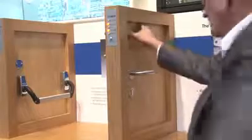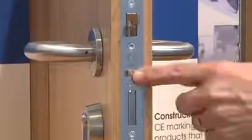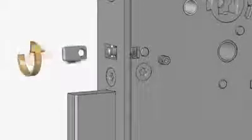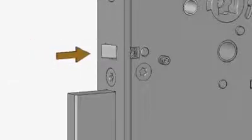The lock case provides for escape even if the door is under side pressure, which is a requirement of the escape standards. The handing is field selectable. The direction of the trigger bolt can be changed to suit inward or outward opening doors, and the controlled side of the lock case can be changed to suit left or right-handed doors.